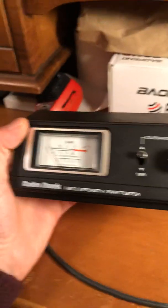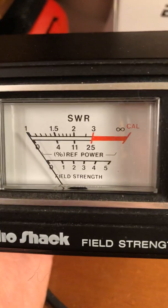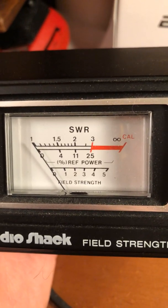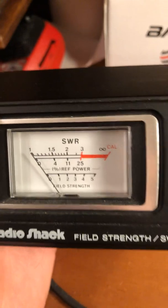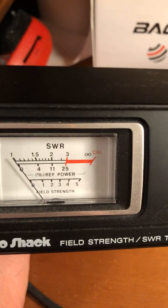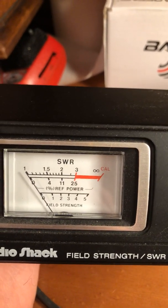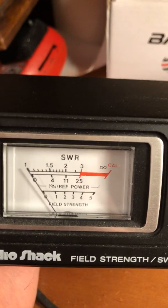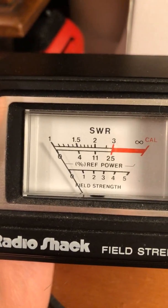This one here is a Radio Shack meter I got like 30 years ago. It's got your field strength and SWR tester, and basically the same calibration scale. Anything below 1.5 is great. If your antenna is only getting below a two and that's all you can do — you've tried adjusting it, moving it, moving your coax around — then fine. You're putting out about 85% power. But if you can get it lower, great. A one-to-one, barely having that needle move, is what you're looking for.